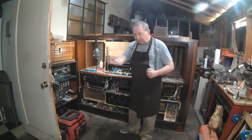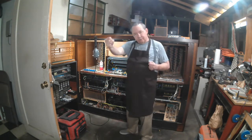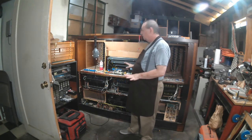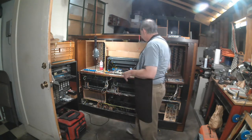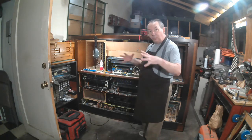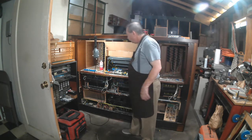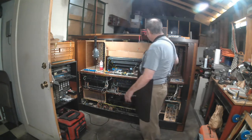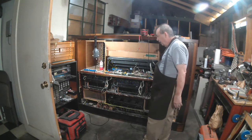We've got our line voltage coming in as alternating current and we transform it down, and now we've got all the various voltages we need but they're still alternating current. What we need is DC — direct current — where the electrons are flowing in one direction all the time. In that case we don't talk about hot and neutral; we talk about positive and negative, or source and ground. To convert AC to DC and maintain our correct voltages, we have power supplies here to run the central processor unit and the stop controls and keyboards, and then there are power supplies on each of these racks.